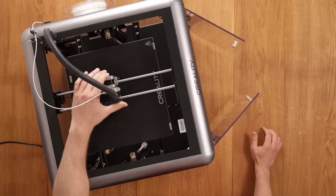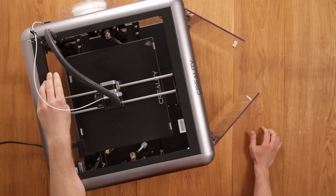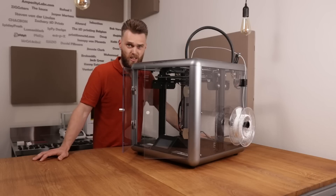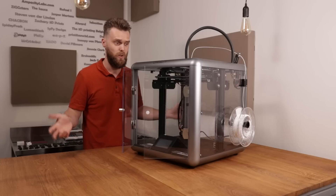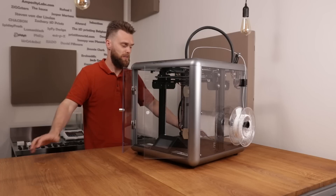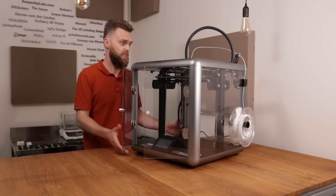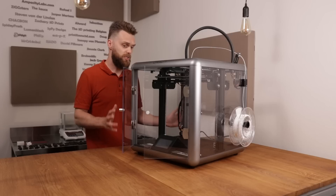This is a full metal hotend, so this implies that you can reach higher temperatures, but the maximum temperature is 260 degrees. This extruder is very good at under-extruding. I'm not a fan at all of this direct-drive extruder. I had to reduce the print speed even below what I normally do with an Ender 3. So for now, the only thing that I can print on this thing is PLA at a slow speed. As it is now, I would just buy an Ender 3. But I like this machine, and I think with some minor improvements we can already get some interesting results.